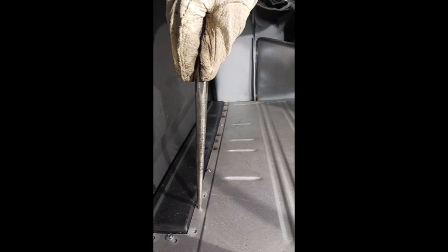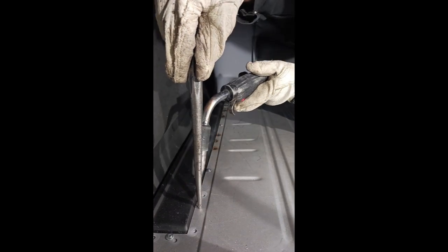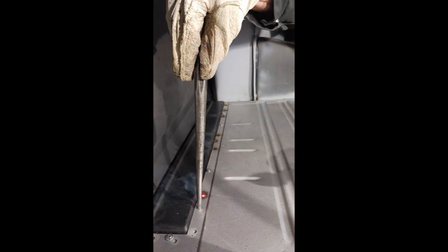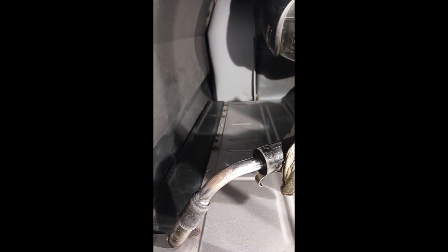We're going to come back and remove those screws after we get this little spot done here. Instead of beating this down with a hammer, which will do no good, we're just going to push on it. We've already got some welds in place. Just because we have set screws in there doesn't mean we can take off after every weld — you want to make sure it's still tight before you hit that next weld.